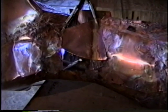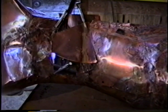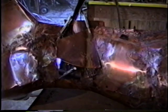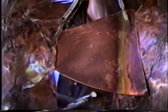What I did, I cut both the halves right at what would be the ankles, strip of copper to one side, then tech screwed the edges together and then stood it up and then angled it until it was right and then clamped these temporary pieces on to hold the other side in place until I could put a permanent strip welded on. Obviously, I had welded a copper tube into the inside of it as reinforcing.